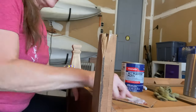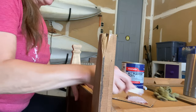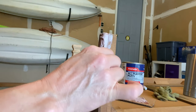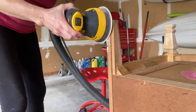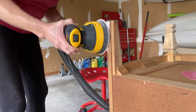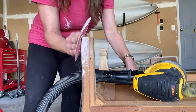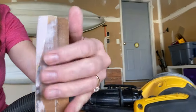The back leg was missing a chunk of wood. It did not compromise the structure of the piece, but I just didn't like the looks of it. I used Bondo to fill in that area. Then, once it dried, I sanded it smooth with my rotary sander, and then finished by hand just to make sure that side is naturally curved. And look at that — I love Bondo.